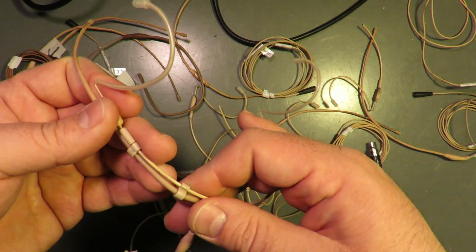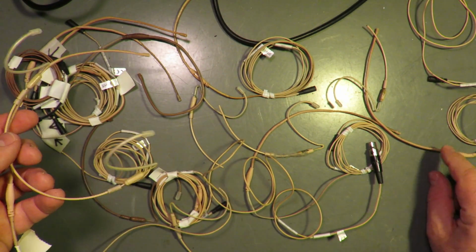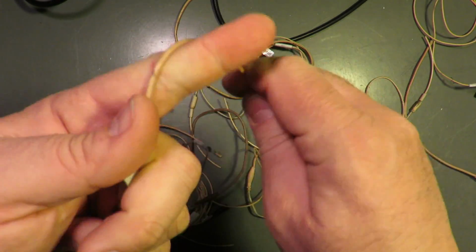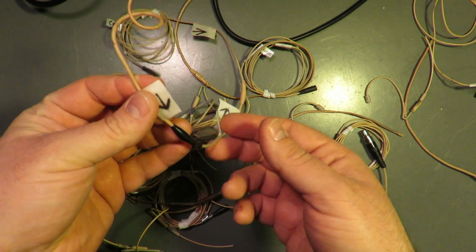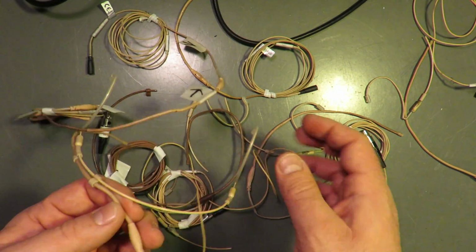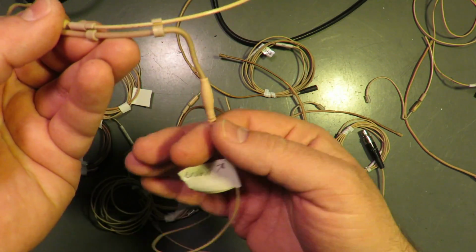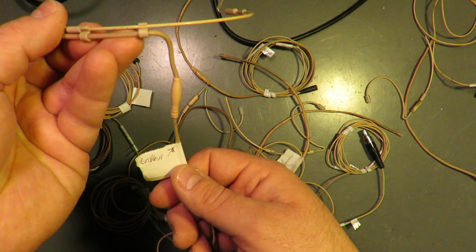And we were pretty excited because in the promo videos for these microphones, it shows how durable these booms are. You can wrap them around your finger, and that's part of the advertising of these microphones. So we were initially not concerned with having this running down the actor's neck, but time and time again, we were losing these solder joints because there was movement in this spot.